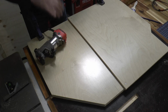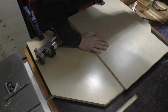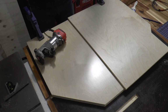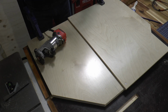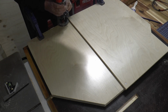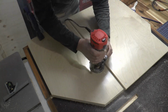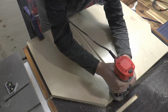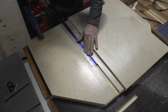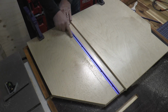For the T-track grooves, I'm using a 3/4 inch flush trim bit in my router along with a scrap piece of plywood as my guide. I will link all the products and tools used in the description of the video, so if you don't have something on hand, you can easily get to it. Then we'll go ahead and test it. And that's perfect.